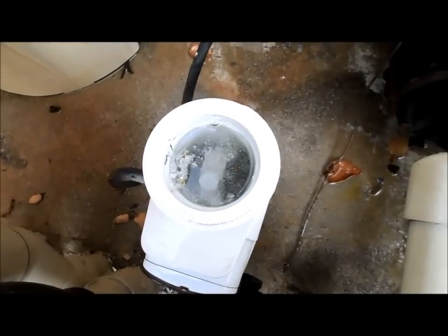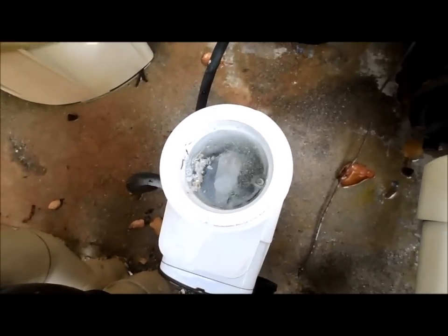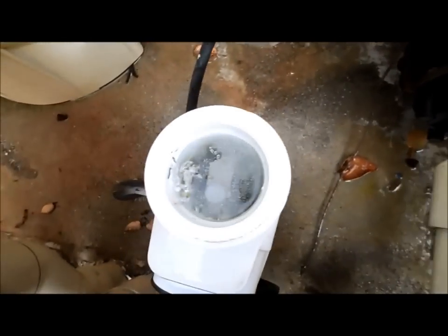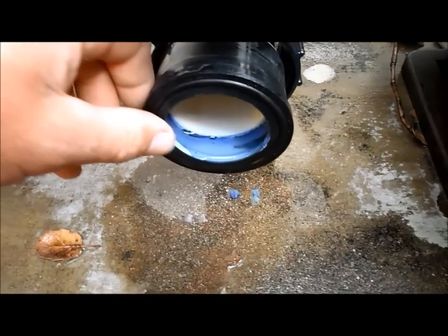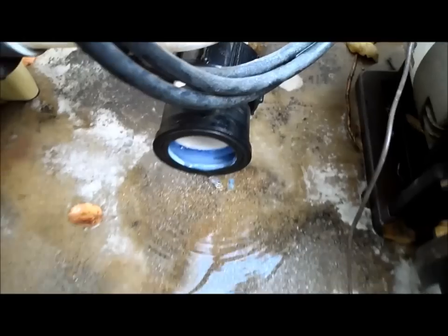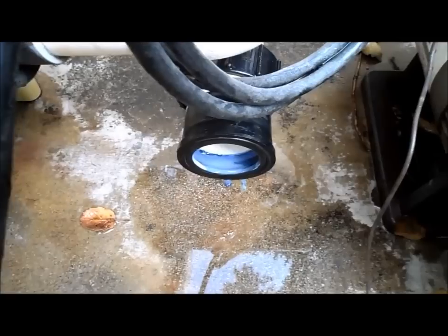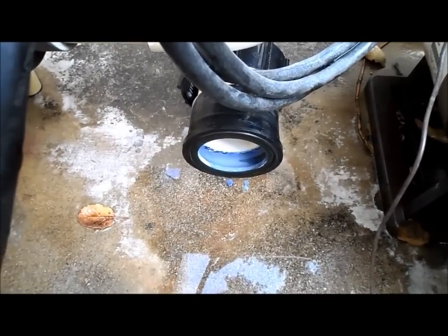After about five minutes it's bubbling a lot less, and it's getting all that calcium build up out of there. It's not leaking because I have the bottom piece on really tight. Sometimes if you don't put it on right it will actually drain all the way out — you'll know you have to reattach the bottom part correctly. Sometimes when they plumb these they put it really tight and you have no leeway, but this one I can actually move the back pipe back and forth to get it on there. You might have to squeeze it in there depending on how it's plumbed. That o-ring needs to be on there, otherwise it will leak, and if it's leaking it will not produce salt either.